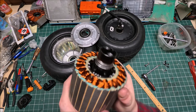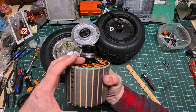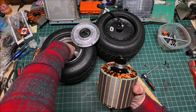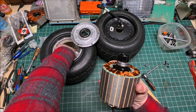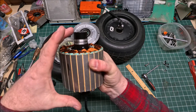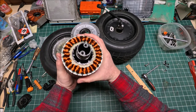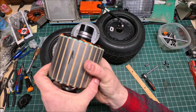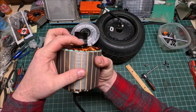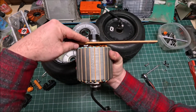Speaking about the winding — it's actually not that great. If you look over here, it looks like the winding has been squashed and smashed. This winding is still kind of sticking out a little bit. I hope it's not going to ground on the support ribs. It looks like when they put the winding in, they also hammered it down, and that style I don't like, to be honest.